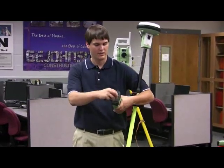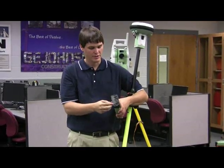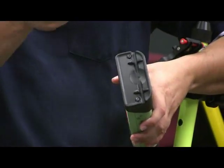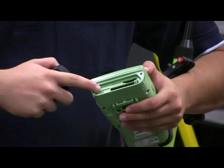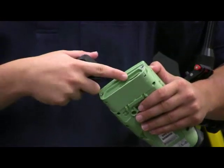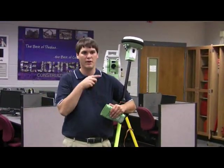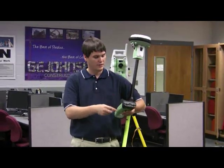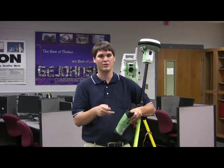The stylus that comes on top has a screwdriver on one end and a stylus on the other, and they put the screwdriver here because there are two screws. If you unscrew the top very carefully — it only takes a little twist, don't keep spinning it — it'll just pop out, it's spring loaded. On the top there are two different types of memory cards: a compact flash card similar to the 1200, or the new SD card, the camera-style SD card. I recommend using SD cards because you can't put them in incorrectly and break all the pins — with compact flash, if you force it in the wrong way you bend all the pins and it's a big expense. Not only can you load compact flash and SD cards, but they also have one gig of internal memory, so it can work without a card.